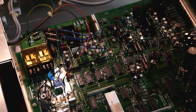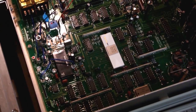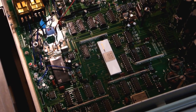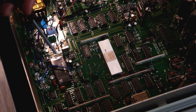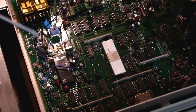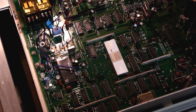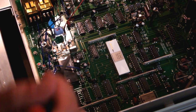So, right back into it. We're gonna have a look at, I think this is just a digital section over here, except for another one of those hybrids. So we've got a third one of these interesting looking hybrids. This one's an RF9417THD688. So very similar numbers, makes me think they're custom for this design. But we'll see if I can find any information on those and annotate it.